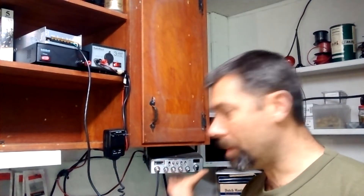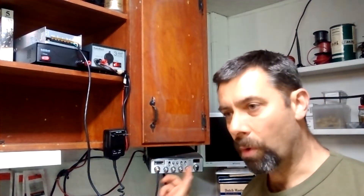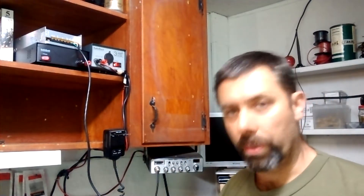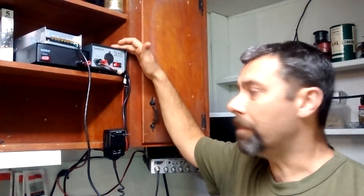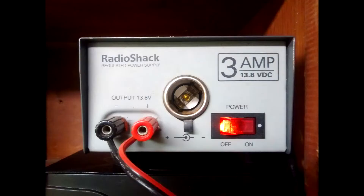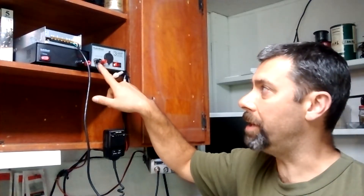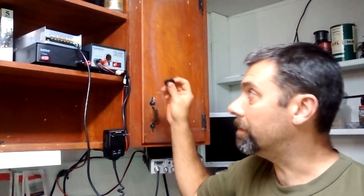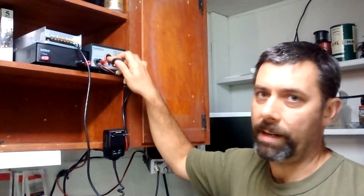When you're thinking about just using a standard radio that hasn't been tuned up or isn't carrying more wattage — just a regular 4-watt AM, 12-watt sideband radio — you're going to need something in the 3-amp range. Radio Shack has the 3-amp, 12-volt regulated power output here. It's nice, it's 3 amps, and you've got your positive and negative connections for plain wire. It also has a cigarette lighter outlet connection if you want to plug something in just for testing, though obviously if you're going for a permanent setup, that's not really the way you want to do it.